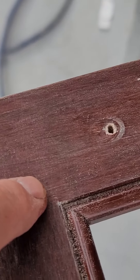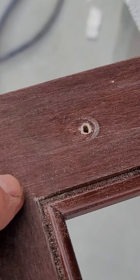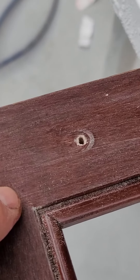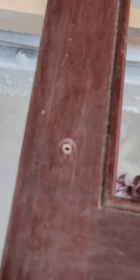Right here you can see one little spot that's still not all the way down — that'll pop back up as fish eye. So you've got to get that down where it actually scratches into that area. The second thing is you have to be careful not to burn through the original finish, because then you're going to have to do some stain repair.